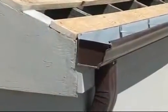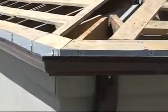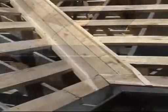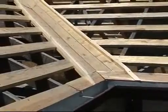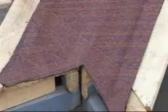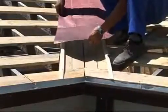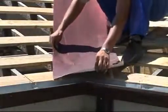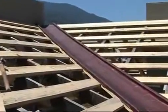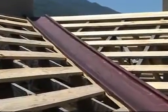If a gutter is required, it should be installed prior to the application of the tiles. The valley must be properly waterproofed. It can be covered with custom-made materials as well as Onduline Group products such as Bituline Torch-On mineral membranes or self-adhesive Reparo aluminium finished waterproofing felts. Once the valley is completed, we can start affixing the Onduvila tiles.